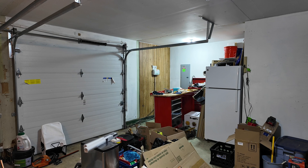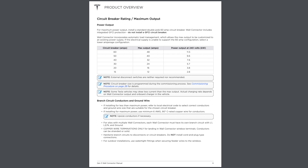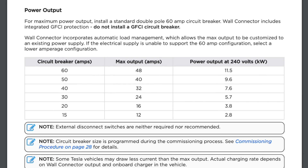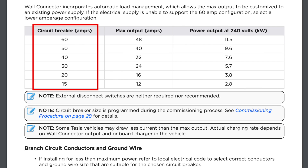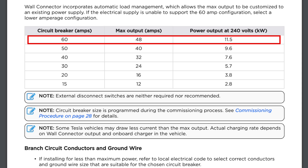The number one question people ask on electrical projects is: what wire should I use? Let's look at page six of the manual. The manual says to use a 60-amp breaker for maximum output. It also states the wall connector has built-in GFCI shock protection, so you must not use a GFCI breaker — just an ordinary double-pole breaker will do, of course the right type for your panel. There's a chart showing all supported breaker sizes and the maximum output for each, which is always 20% less than the breaker rating for safety. I'm going to use a 60-amp breaker, so I can expect a maximum charge rate of 48 amps or 11.5 kilowatts.